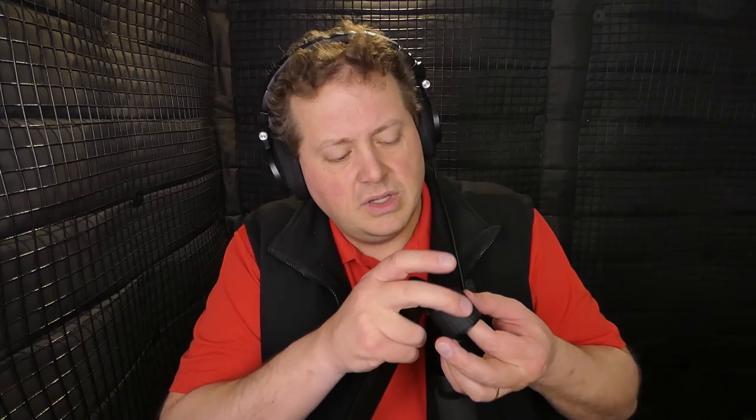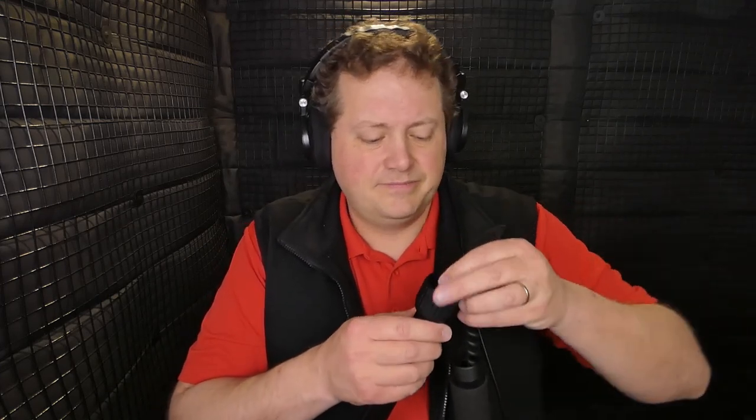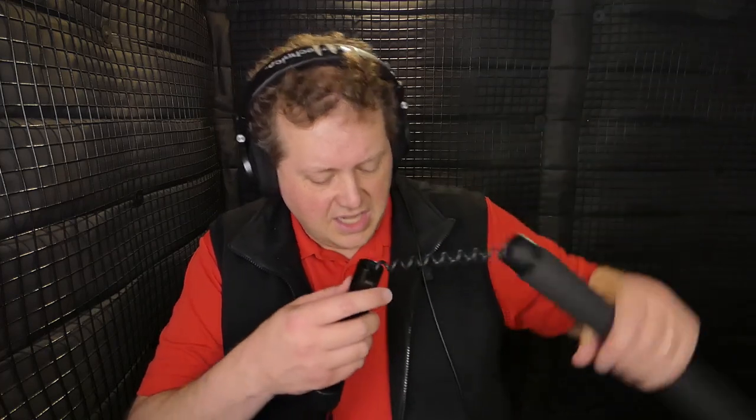This is the compression ring. There's no lubricant anywhere on this plastic, and there's no rubbery material of any kind on the inside of the compression ring — nothing like what you'd want to have inside a boom in order to compress the ring. Right now it's relying on sheer pressure from cranking the thing down in those threads to lock by pinching tighter and tighter until it pinches off the aluminum. This is a terrible design — there's no stopping friction force at all, no rubber, nothing. It's going to be stopped only by sheer willpower and by you cranking it. Not a good design at all.